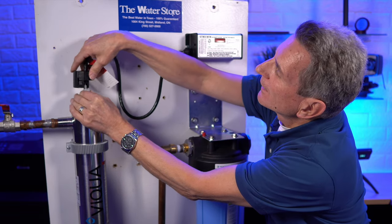Warn everyone in the household that the first toilet flush may have some gurgling and bubbling. If your UV system was shut off for a period of time, or you fear there may be bacteria downstream of the system, then you need to disinfect the whole system — I've got a YouTube video for that in the description. So can you replace your UV lamp yourself? Absolutely — just follow your manual and the tips and tricks I've presented today, and you'll have no problem.